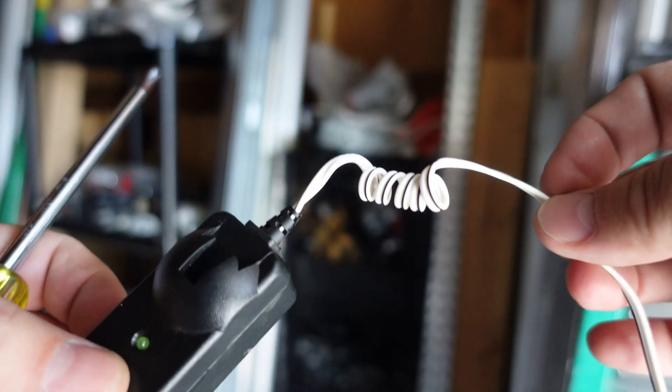We have installed the motor — we've already hung the motor. I've got the wall button on. The last thing I pretty much need is installing the safety sensors. These are LiftMaster safety sensors, and they do require a bracket installed either onto the track or onto the wall. Some guys like to make little squiggly curly cues — they call them pigtails or swigglies. The idea is that giving yourself a little bit of slack helps with the wire not binding, not pulling too much on the safety sensor.